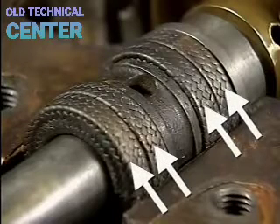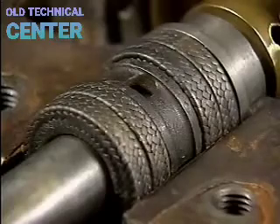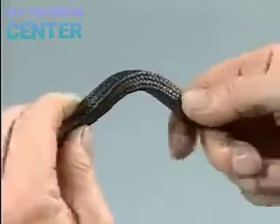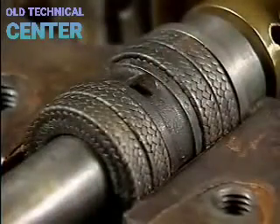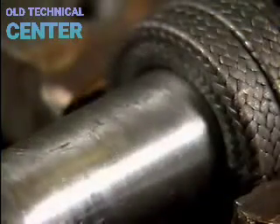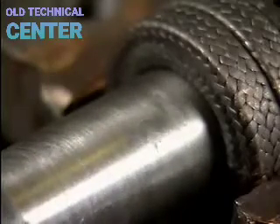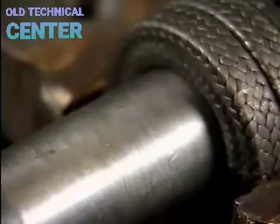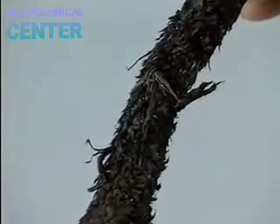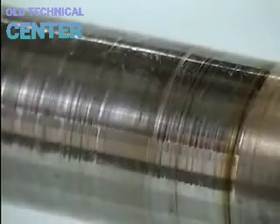The packing material provides the seal controlling leakage between the shaft and casing. Packing rings are made of soft, pliable material resembling short lengths of rope, filling the space between shaft and casing. Because the packing is soft, the shaft can rub against it without damage. However, it must be kept lubricated to minimize friction and heat. Without proper lubrication, friction from shaft rotation can generate enough heat to scorch the packing — and scorched packing could cut grooves in the shaft.